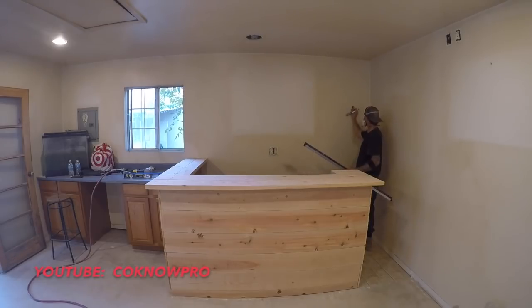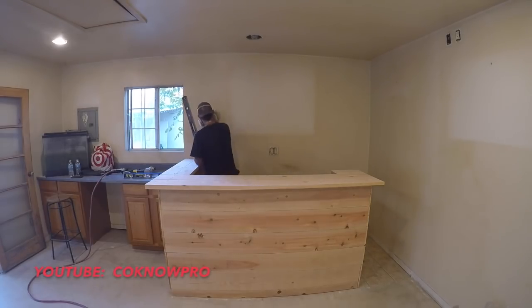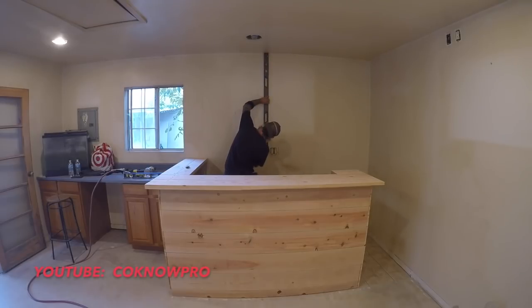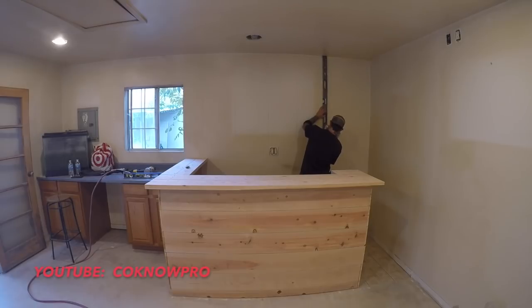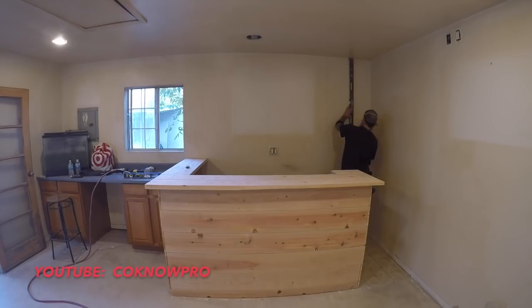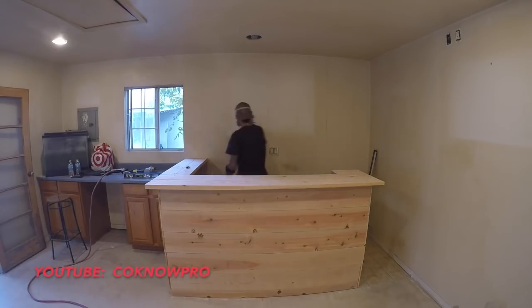Nice. Now we're going to start rocking on this wall unit. So first off, we want to find our stud layout, and then we're going to level up on all our studs. That way we have backing when we install our 1x8 dog-eared fence plank, butt jointed. All right, and then after we run all of the fence planking against that back wall, stagger the joints too.